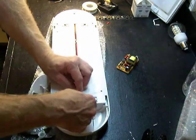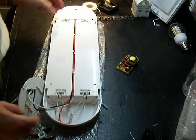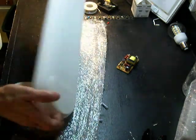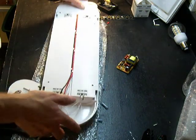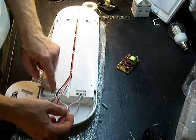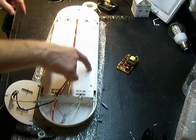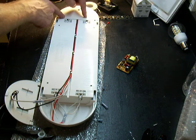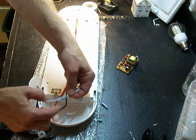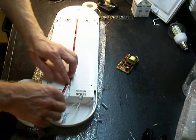Then I take the wires and dress them back nicely. So let me just sort of recap here. We had power coming in the black wire, it goes down to our switch, comes back from the switch — so we've got switched power. We Y it, meaning we go parallel to the two ends of the tombstones on this end. The power goes through both tubes and comes back from these white wires, which cascade down the center. We took those two white wires and returned them back to ground. So that's it — basically Y into the two tubes, Y out back to ground.